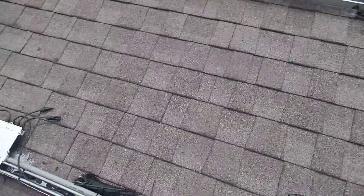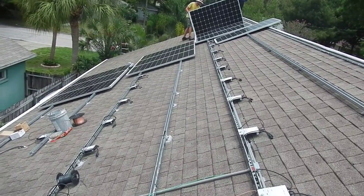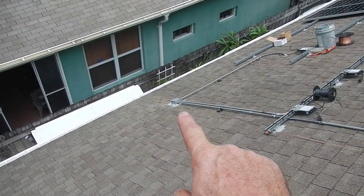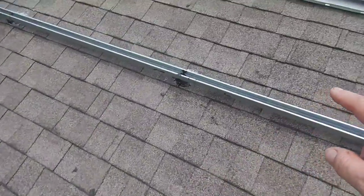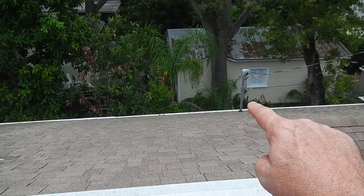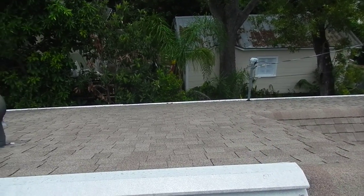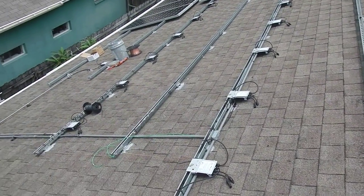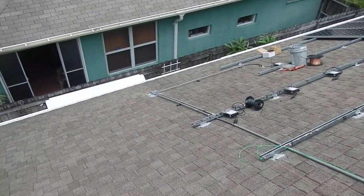This is due west, so we increased a little bit. We ran ethernet from the inverter, which is right below the junction box in the kitchen, all the way to the other side where the meter can is - that's where we put our disconnect and breaker box. A little unusual, so we had a long AC wire run, but AC can naturally run a long way. The DC is fairly short. Our conduits go right down to the junction.